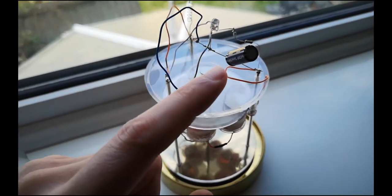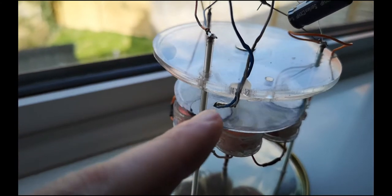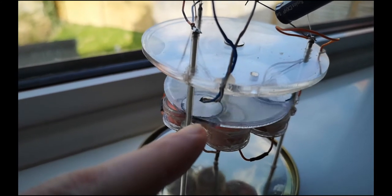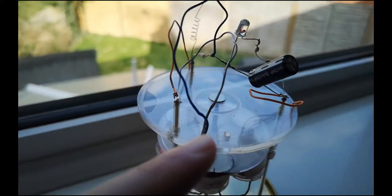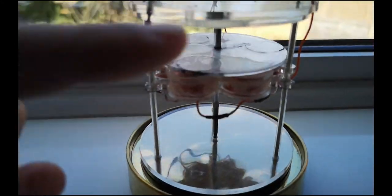Then coming off there, we've got a little reed switch here that's triggered by these magnets on the rotor, and that switches the supercapacitor to energize these coils. There are six coils